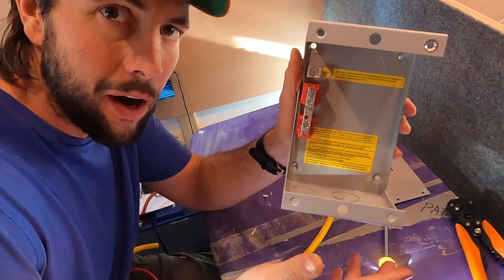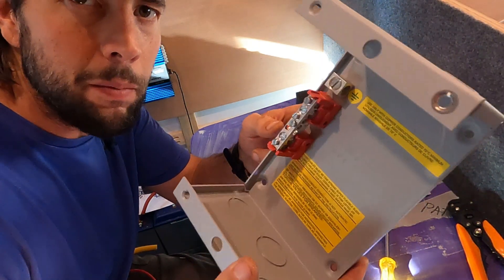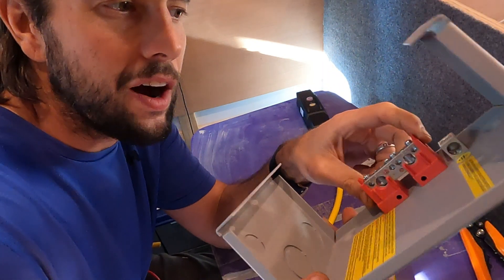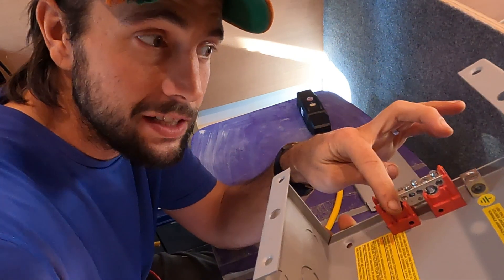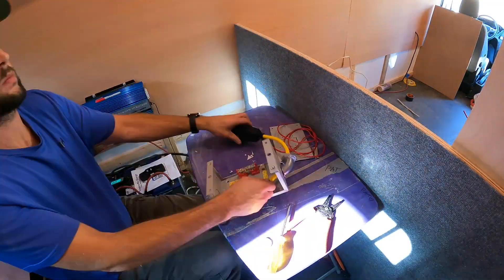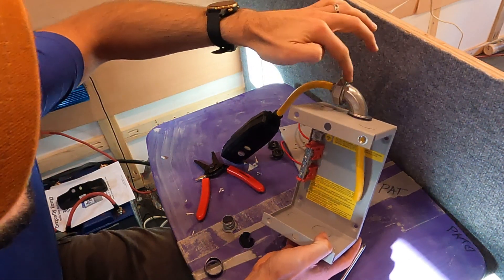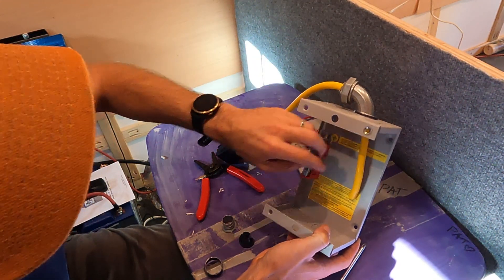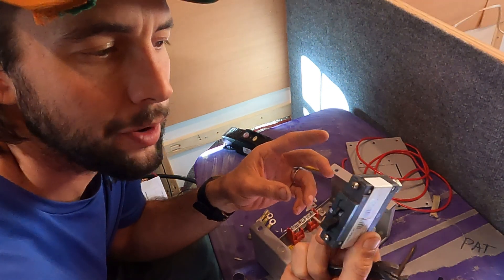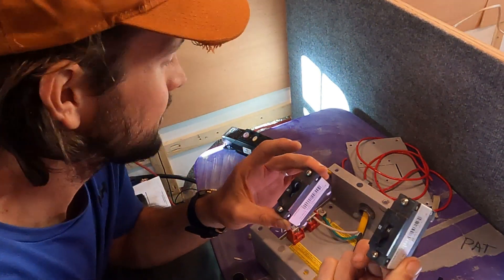I got my Midnight Solar quad box — I'll have links in the description for all these parts. I got my insulated common bar and put it in with some number 10 countersink screws on the back, then I used the grinder and flattened them so the bar is floating off the plastic, not touching the metal, so it won't cause any problems. I knocked out my top piece, got my inline hooked up, ran my cord through an entry gland, and now I'm going to strip the wire and hook it up to the ground and neutral.